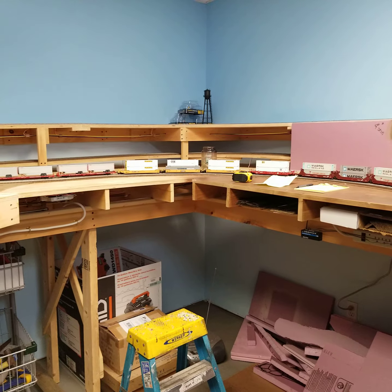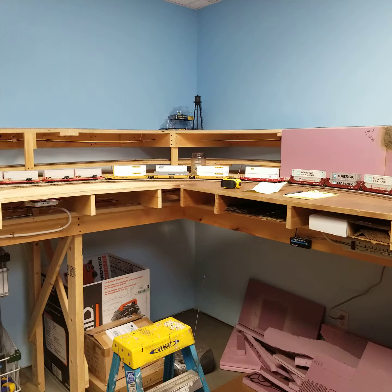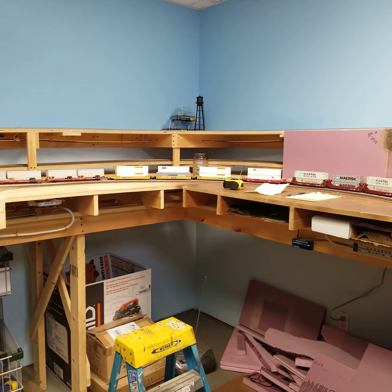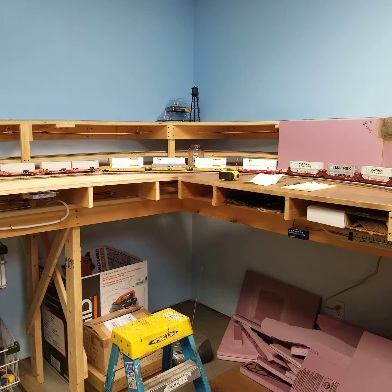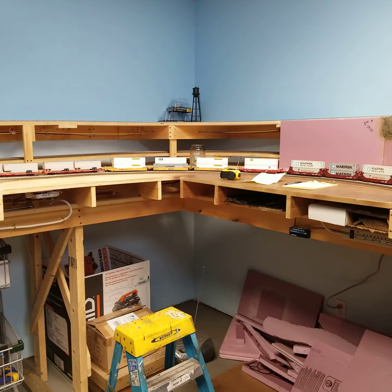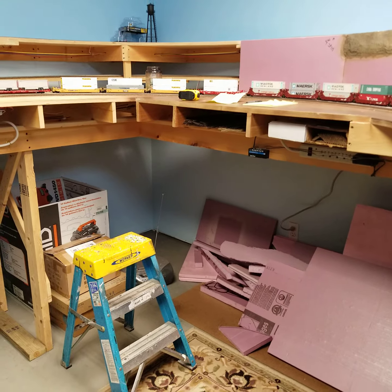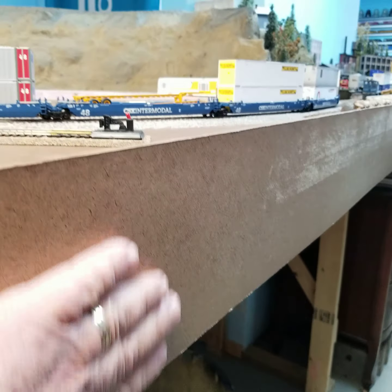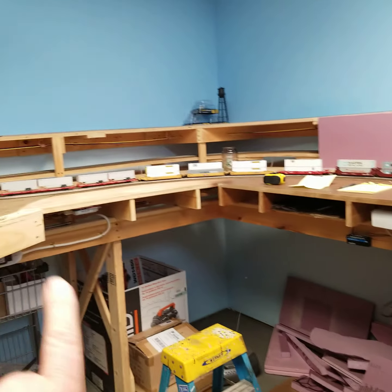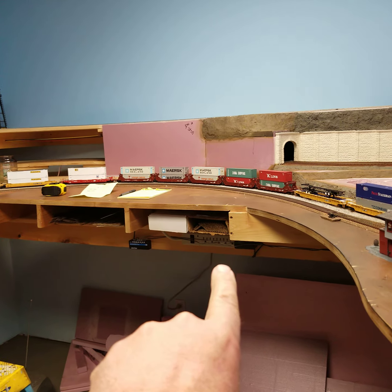Once I get that one-by-four on the flat underneath, I'm going to put a one-by-five upright on the whole face. I'm going to have to drop it down with a quarter-inch reveal on the top and the bottom. Then I'll apply my hardboard — hardy board, whatever you guys want to call it, everybody calls it something different — but it's some fantastic stuff.